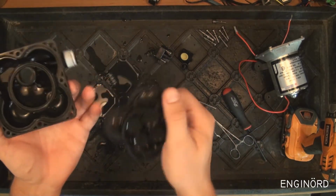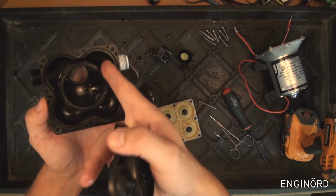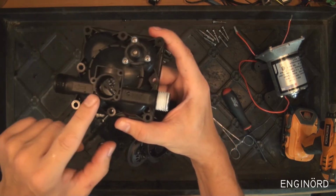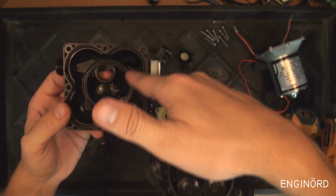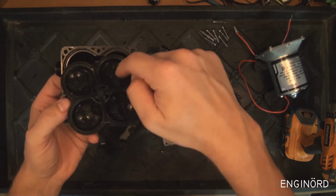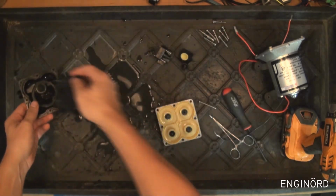And the way this is done, you can see there's a central seal in the center here, and when this guy sits there, then this outside area is the inlet, so that's where the water is coming in, and then this center section is the outlet. And we can verify that easily. You can see the arrow points in this direction, so this is the outlet and this is the inlet. So again, the water comes in through this port, it fills up this outer chamber, and then it comes into one of these 4 chambers, and then these valves, the in and out valves, are regulating when the water is coming in and out, and essentially it fills up this cavity, okay, and then through this cavity, through the outlet, it will leave the pump body.